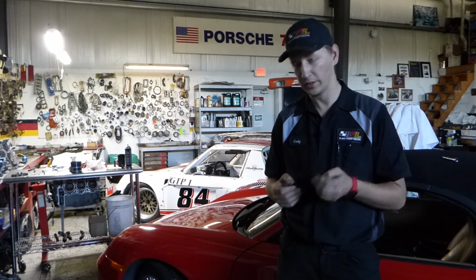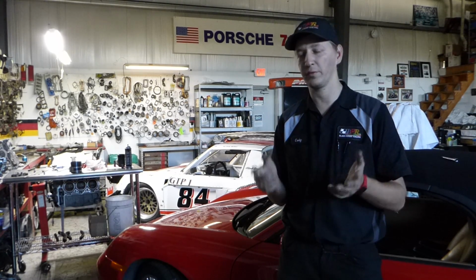So if you're in the aircraft industry, I could see that potentially the tolerances there are going to be much lower. You're going to be using a way more expensive torque wrench than just off-the-shelf Snap-on units. So your margin of error is probably going to be a lot lower, and then maybe I could see it making a difference. But for everyday automotive use, even for race cars, it really just doesn't seem to make a difference that matters in the real world.